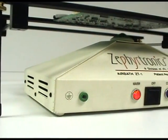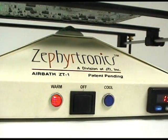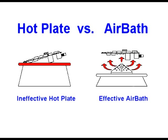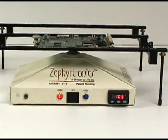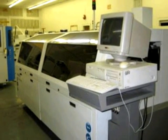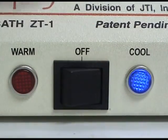In the early 1990s, the now-patented Zephyrtronics air baths introduced engineers and technicians around the globe to the world's first stand-alone temperature-controlled bottom-side preheating system. Because its force convection mimicked the benefits of preheating PCBs with an oven, the air bath could deliver preheat into all the nooks and crannies on the bottom side of a PCB, unlike a hot plate. With closed-loop sensing and thermal control built in, your PCB can be ramped to temperature at the industry-recommended rate of 2 to 4 degrees C per second — no technician guesswork, no do-it-yourself thermocoupling. And just as all high-volume PCB conveyor ovens have a cool-down zone for stronger solder joints, the Zephyrtronics air baths feature a quick PCB cool-down switch right at the front panel — mandatory for any BGA rework.